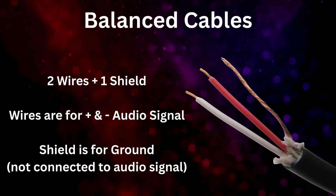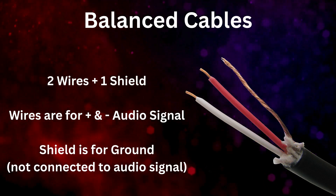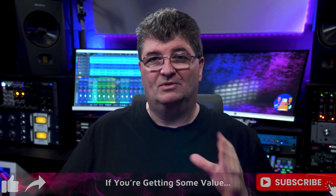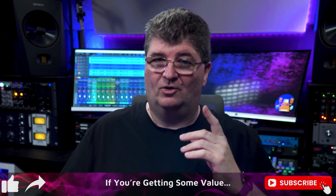Here's what they look like inside. XLR and TRS cables contain three components: a shield, a positive wire, and a negative wire. TS and RCA cables only have a signal wire and a shield or ground. It's the construction in the XLR and TRS cables that makes the difference — only cables with two signal wires can support balanced connections, which means better noise rejection.